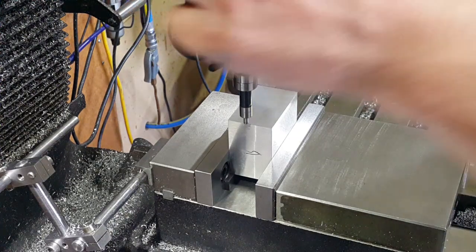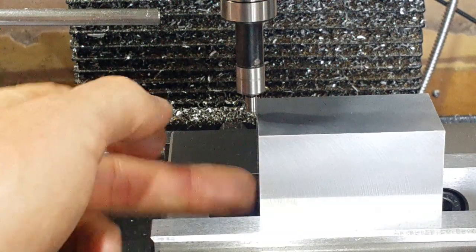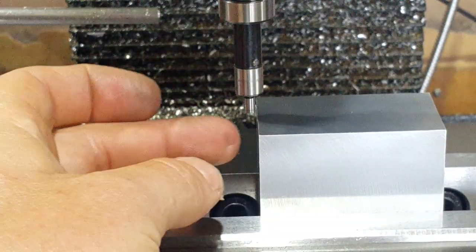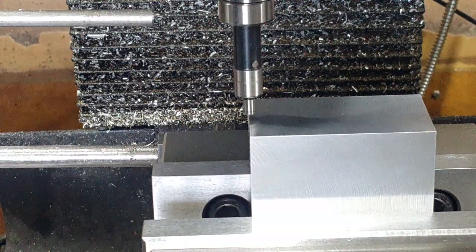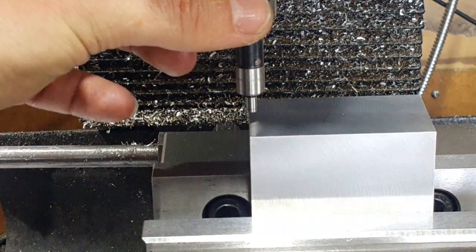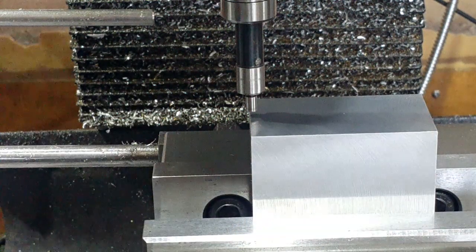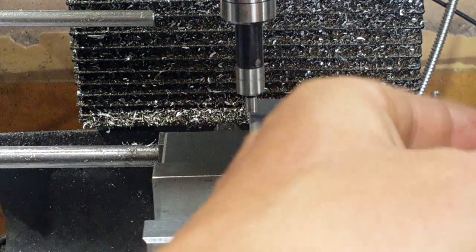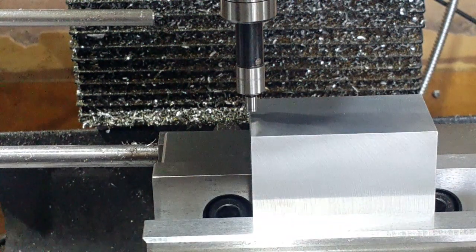Right, so we've found our dimensions in the Y-plane and also in the X-plane. The tip on the wiggler is four millimeters in diameter, so at the moment we've got that sitting on the edge here. To get the center line of the spindle to the edge of the work we need to move that up two millimeters. Now we'll have the center of the spindle dead on this line here. We'll go and set this to the middle of the width of the block and then move up from that point three quarters of an inch, then go through a series of drills to get up to a certain size and then change over to the boring head to bore it out to the finished size.